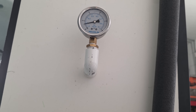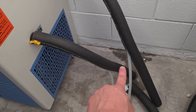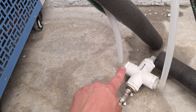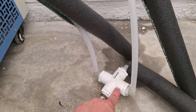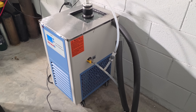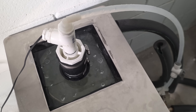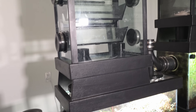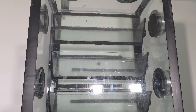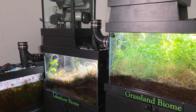But already by the next day, the pressure began rising to an uncomfortable level. The chiller pump was still pushing too much pressure into the line, and that's when I realized that adding a bypass can relieve extra pressure by returning some of the water back to the chiller. With a quick modification, the bypass was added, and that did the final trick. The pressure dropped to zero instantly, and the temperature the chiller generated circulated perfectly. The results of the new heat exchanger design were finally everything I hoped for, which was exciting — but now it was time to upgrade the remaining three atmospheres.